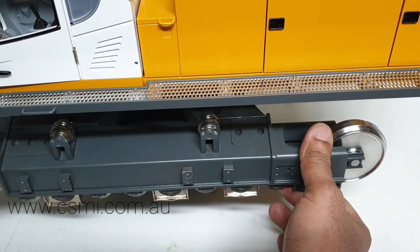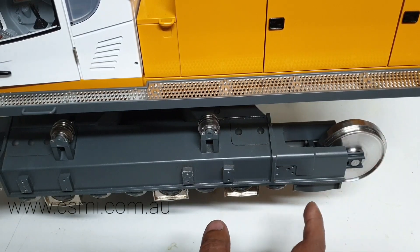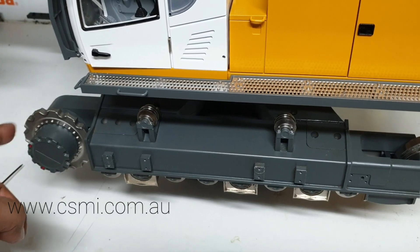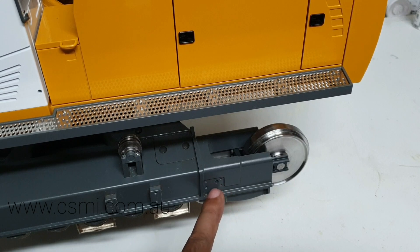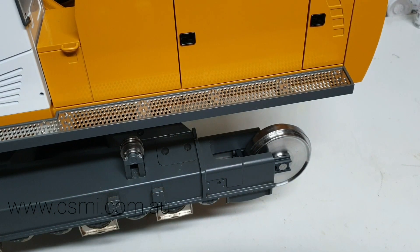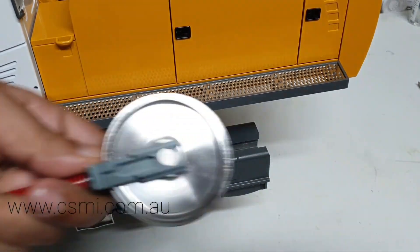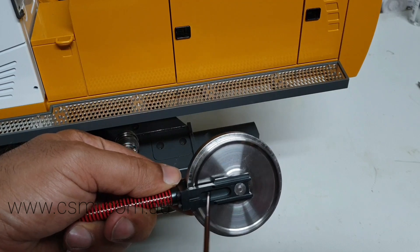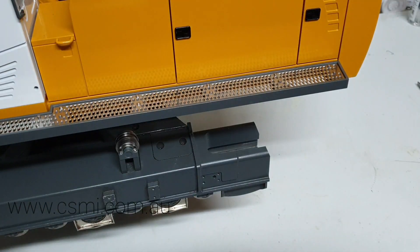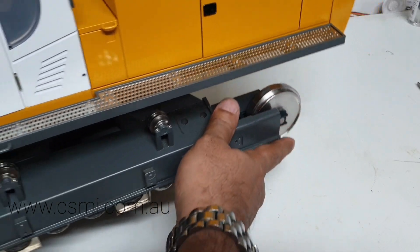Once it compresses, you put a pin in and then release the F-clamp, and the wheel will stay retracted. Once it stays retracted, the first side you want to take out is the idler side because it's got no teeth. However, if the idler side is too tight and doesn't come off because it's freewheeling, you can go to the other side where you've got the sprocket and the drive. So: put the F-clamp in, compress it, put the pin in - it stays in place. Take your F-clamp out, and then take the track off. Be careful - make sure you've got it locked properly, otherwise it's going to spring like a bullet. This is where it gets locked - the pin actually goes into the slot and stays pulled back completely.